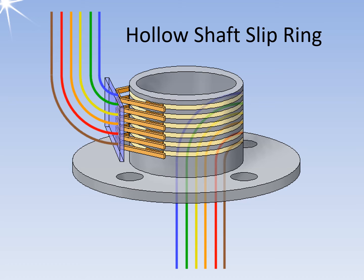The waveguides, along with the rotary joint, can then be installed inside the hollow shaft. To ensure the lowest possible contact resistance, the slip rings and the contacts are usually hard gold-plated. The contacts must not flutter, as it would generate a sequence of pulses instead of a DC voltage. Therefore, the contact springs of the slip ring must press on the slip ring with sufficient force.